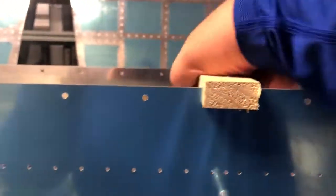When I release the clecos or release the pressure, it's going to open up and create a kind of spring action to hold it there. So this will help me keep these pieces, and I can just slide this down as I'm working. So I created one for each end. That might have been overkill. Definitely one for the center and one for the end.